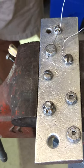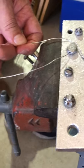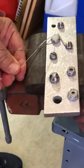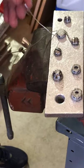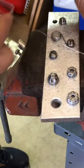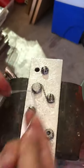Put it through the hole. This is where I like to use pliers because these are sharp little ends. I'll pull that in and use my pliers to pull it tight. Bring that around. I'll pull this one in, and now this time I'm gonna go backwards because I want this one to come underneath this piece of safety wire. If you go the other way it's gonna tend to climb over the top of the head. So I go underneath — again, six to eight twists per inch.